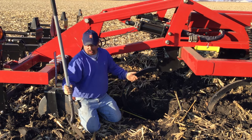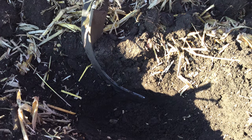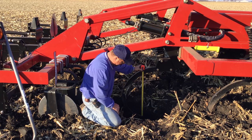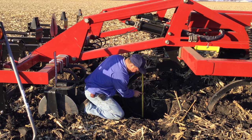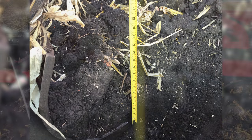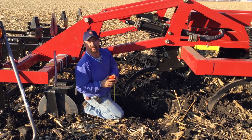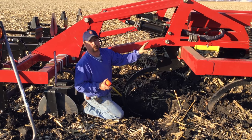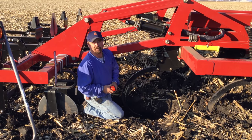We take a shovel and dig down underneath that shank. I've done that in this spot in the field, and now we're going to take our tape measure and measure the depth. We take the tape measure to the bottom side of the point and measure up to where the soil surface is. We've got about a 12-inch soil density layer right about here — I'm running about 13 inches in depth, so I'm just about right there. If I could go just a little bit deeper I'd ensure I'm getting underneath it and getting some lift and fracture, so I'm real close to 12-13 inches.